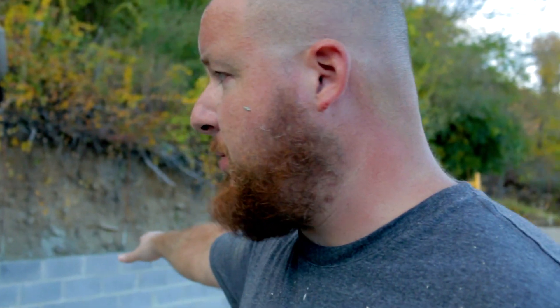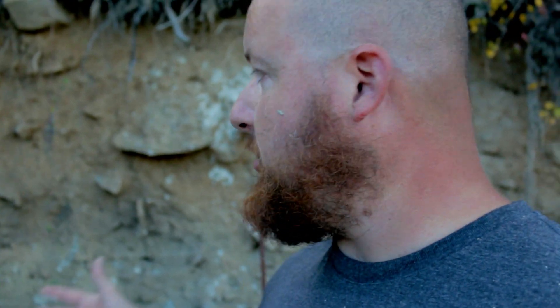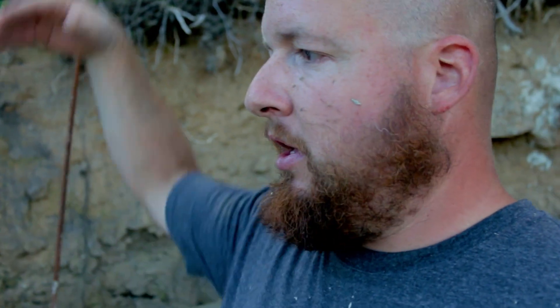That's our bond beam. We're going to start back at it — we probably won't film coming up to our third course, but we might film stepping that back. We are going to have to put grout on our third step back just for where we have our wall, but other than that we aren't doing a bond beam until the very top. We have six more courses to go. We could have done a bond beam in between there — I chose not to. We're just going to do the top one. These bottom ones — the thing I was most worried about was right back here where we had all of that water accumulating. So we're going to do some special stuff on the outside to deal with that. Most of our push and heave is from down here at the bottom, and that's why we chose to skip all the way up to the top to do our next bond beam.